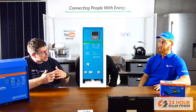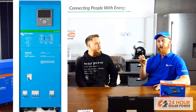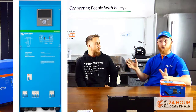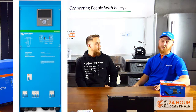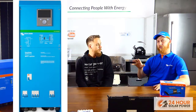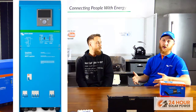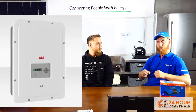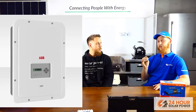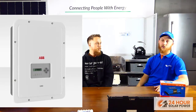So let's talk about the Victron Easy Solar. The Victron Easy Solar is an inverter-charger — it takes the DC from the batteries and converts it to the usable AC we use every day at home. It's a five kilowatt inverter, meaning you can run toaster, kettle, fridge, lights and so on. At night, that five kilowatts is all you have available — so if you turn on all those things and the microwave comes on, you'll have a momentary blackout. During the day with the AC-coupled system, however, if the microwave comes on the AC coupling simply ramps up to handle that load and runs back down once it's done.